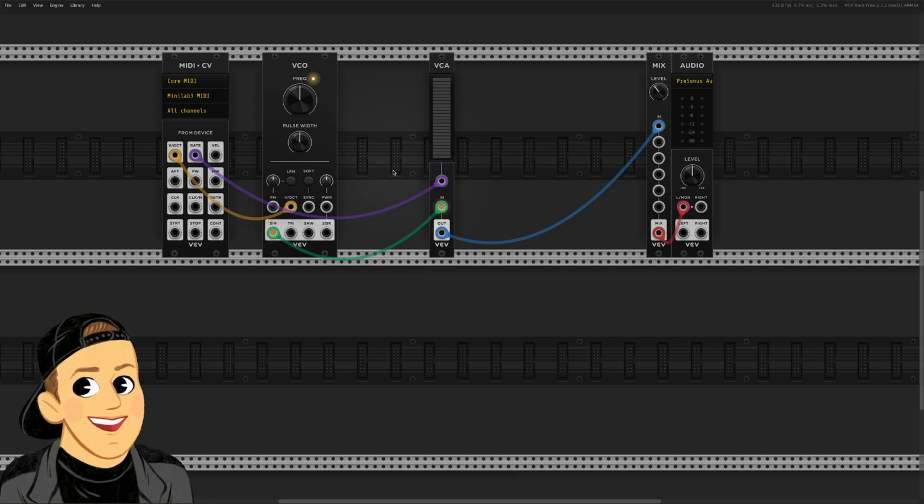There we go. That actually is starting to sound like maybe a toy piano that you might have had as a kid at that point. Super fun. So as I press a key, it turns on our VCA because of the input. You can see it's going from no volts to 10 volts, turning it up. And when I let go, obviously, it shuts back down to 0. So that's cool. At that point, we can play little melodies.